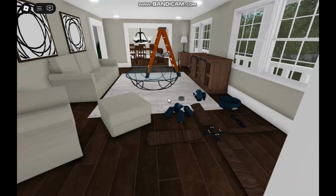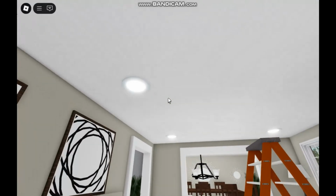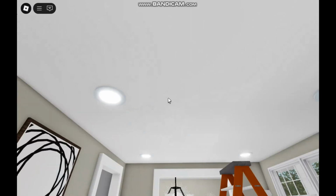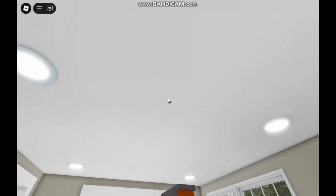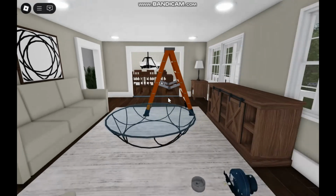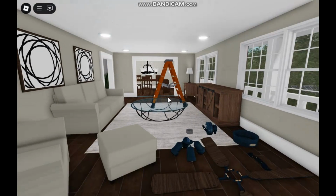So, they can't install the ceiling fan without getting a swag kit, and they don't want to get a swag kit. So, what we're going to do, guys, is that we are going to take one of these light fixtures, take the wires, connect it to the light fixture, and connect an extra wire from that, and then add a junction box here. Feed those wires into the junction box, so then the fan will turn on with these lights. That is the plan. That is the easiest route. So we are gonna go ahead and get through that.